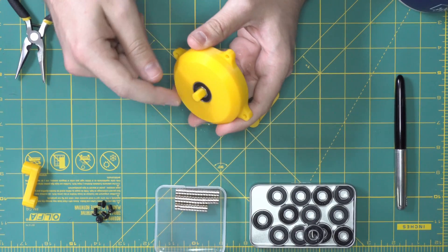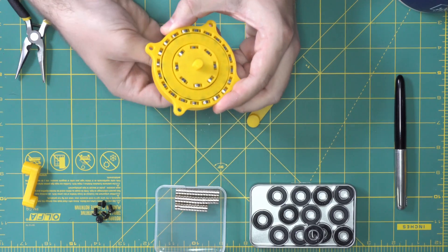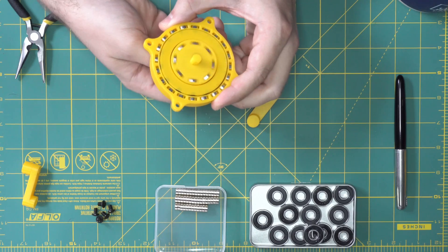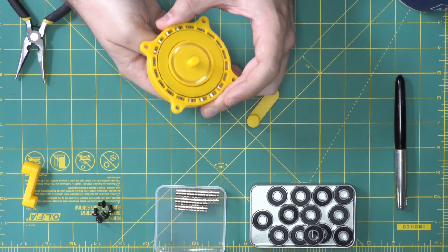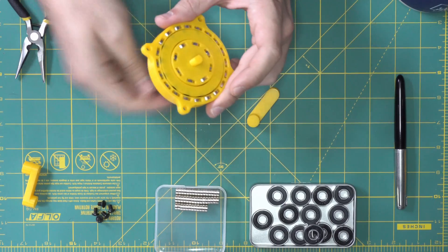To summarize: when you spin the shaft, this middle ring — which has the screws in it — will spin. And that changes how the magnetic fields interact, which spins the middle one with a gear ratio that is a function of the number of pole pairs in both the inner and outer ring and that interaction.